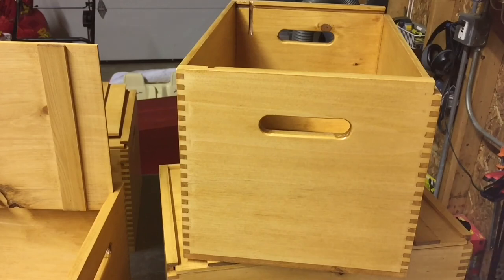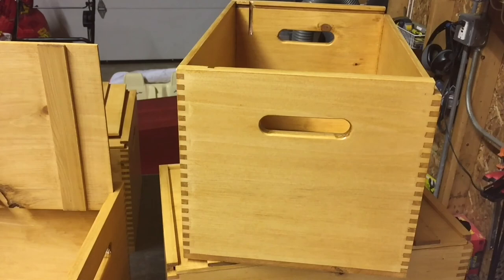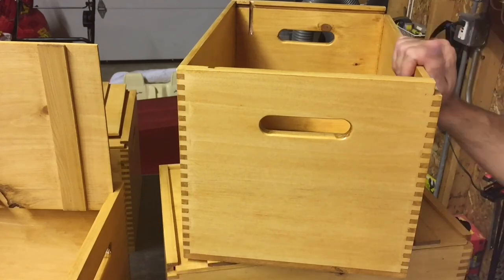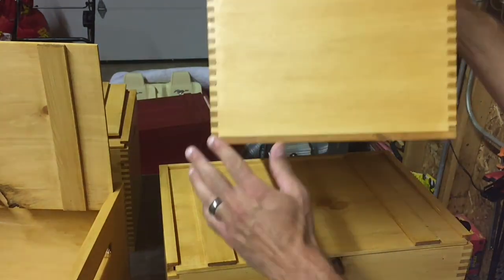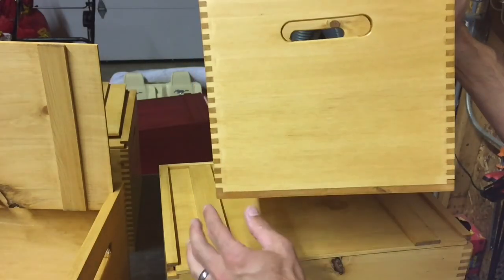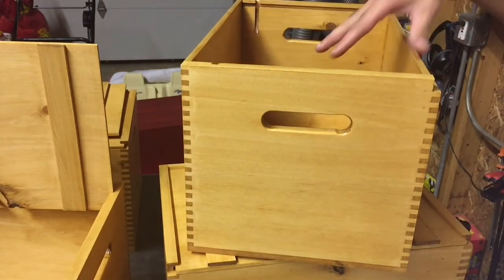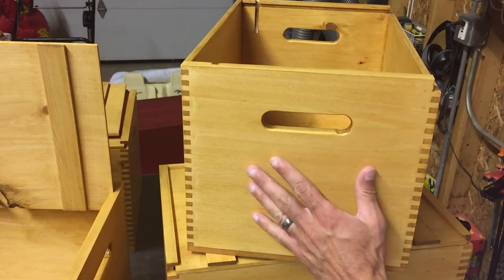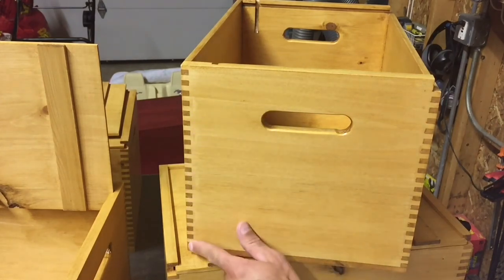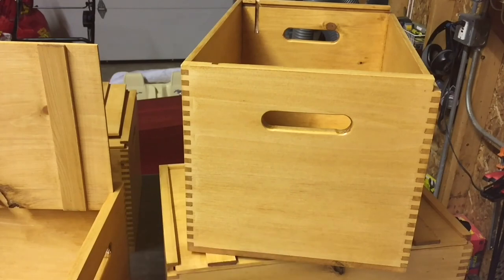For the wood, I'm using a common board from Home Depot. They come in 1×12 by various lengths; the actual dimensions are ¾ inch thick and 11¼ inches wide, sometimes even a little bit under that. That's the limiting factor because the bottom board needs to be the full width of your plank. The original boxes were 12 inches, but you can still fit a case of beer inside even at 11. I'm also selecting wood and cutting my blanks so I don't have too many knots — especially where I'm going to have finger joints. I never cross-cut where I'm going to have finger joints, because a knot will throw off the pins and it's not going to work.